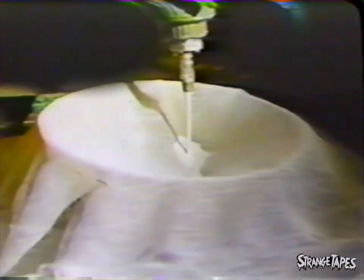This is generally known as the feeding room, where the latex is fed into the manufacturing line. Glass formers called mandrels are dipped into the liquid latex. Glass is used because it coats smoothly, helping to prevent defects from forming on the surface, and permits easy removal from the mandrel.